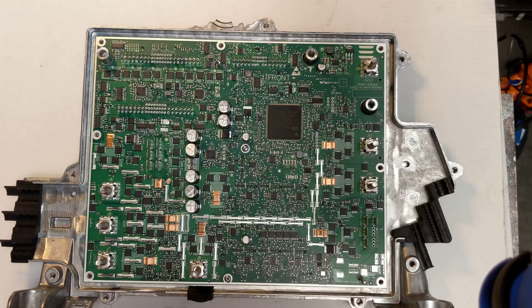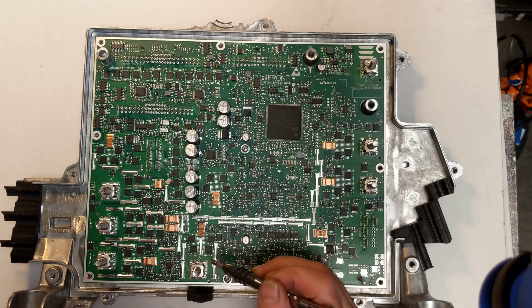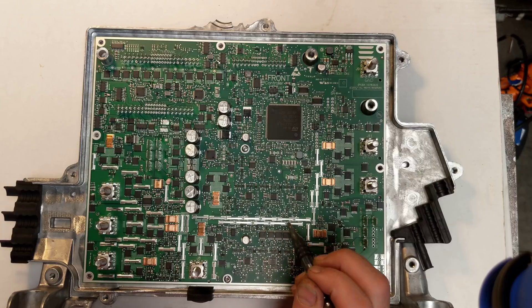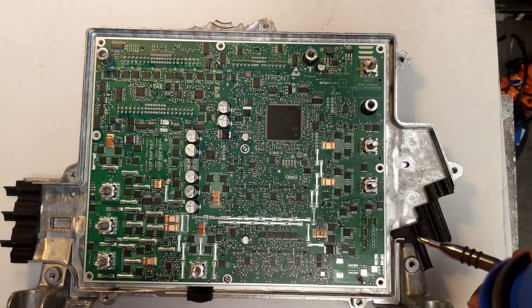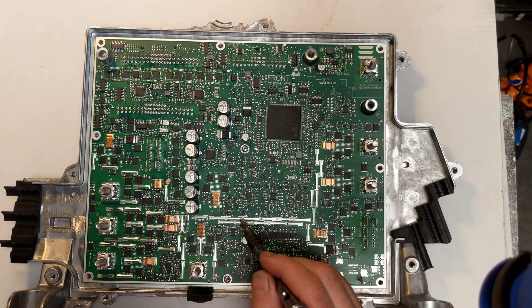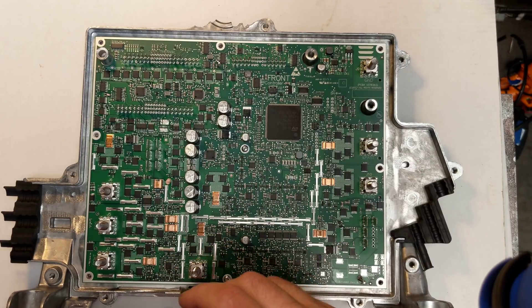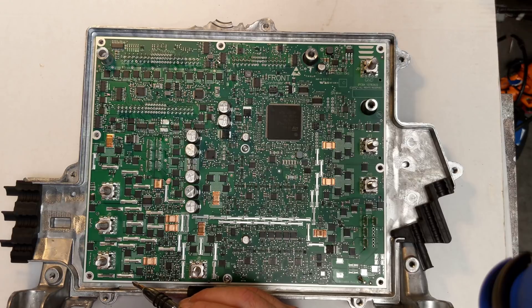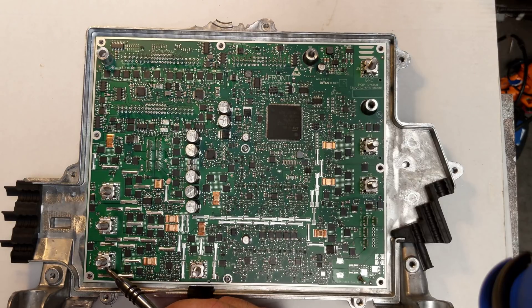If anyone has any questions, please ask them in the comments and I'll try to answer them. Also interesting is we see these little soldered-on bus bar sections to increase current handling of the board — that's delivering positive to different sections of the board. That's an interesting way of handling it, because these can also be put on with automatic pick and place; it doesn't require any hand work. The only exception are these interesting posts which are pressed in — not soldered, literally just pressed into the board.